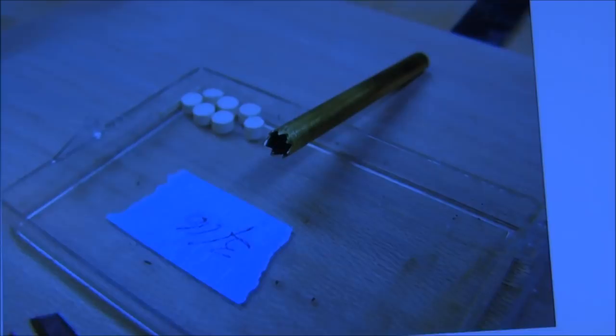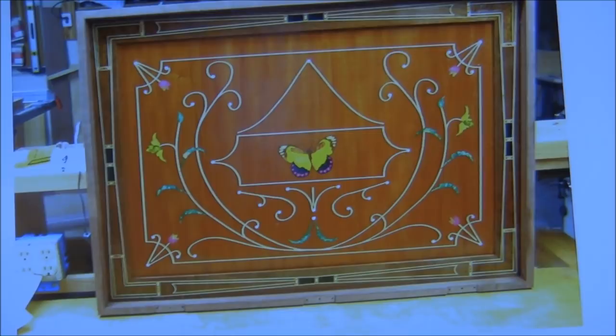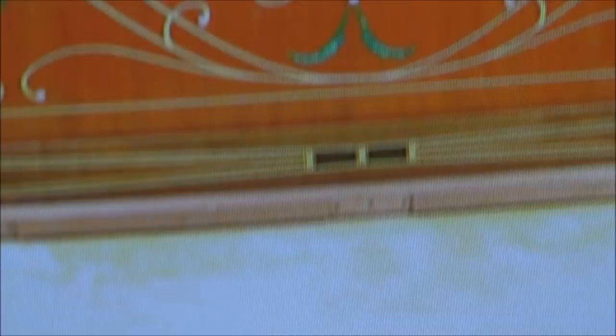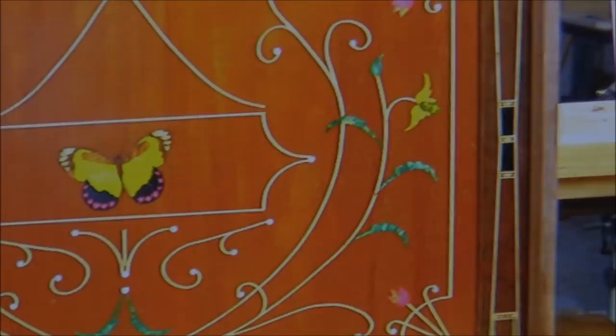This is the top of my last turn-of-the-century cabinetmaker's tool chest — I put everything in it. It has pattern routing, scratch stock, and inlay. You can see the border going around the frame was patterned after a Hepplewhite table leg, so it's got a cuff, banding, little short pieces on top of the black, stringing, and an oval shape. The inlay is mother of pearl. I threw in a few flowers, and since my trademark is butterflies, I had that space up there and said I'll put a butterfly in it.